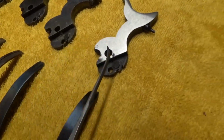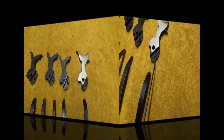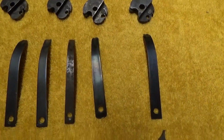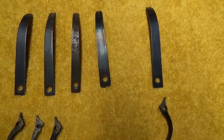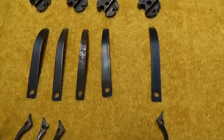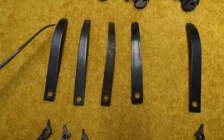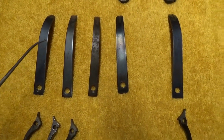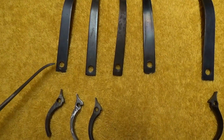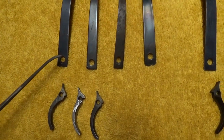And I said before in another video that does not really be an issue as far as I'm concerned. I'm dropping down from the hammers here. We're going to come to our mainsprings, and these are the things that you probably have the least amount of problems with. I don't think I've ever had one break. I have seen some where somebody has taken a grinder and kind of reduced the tension on these things. Various ways of doing that. Some people put a piece of leather in the back between the mainspring here and the frame itself.